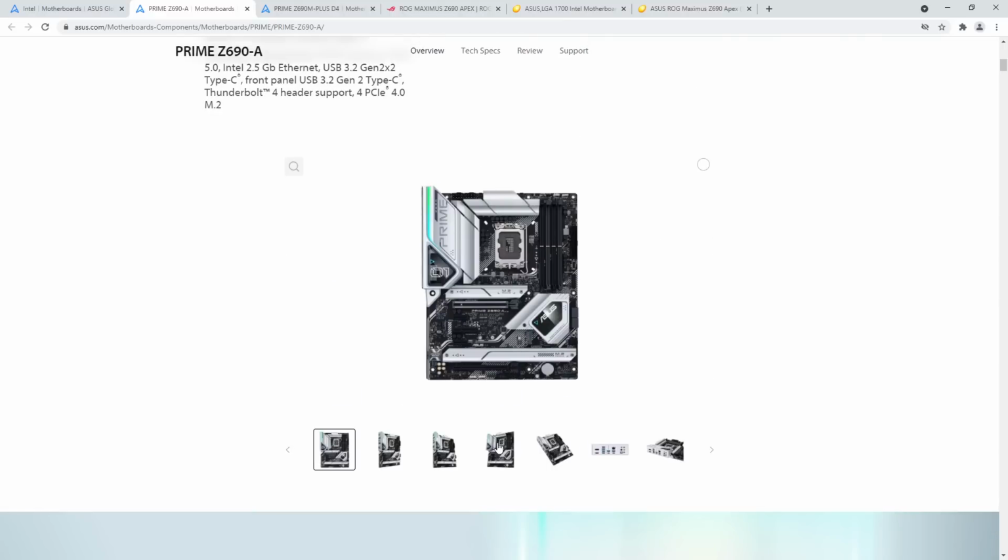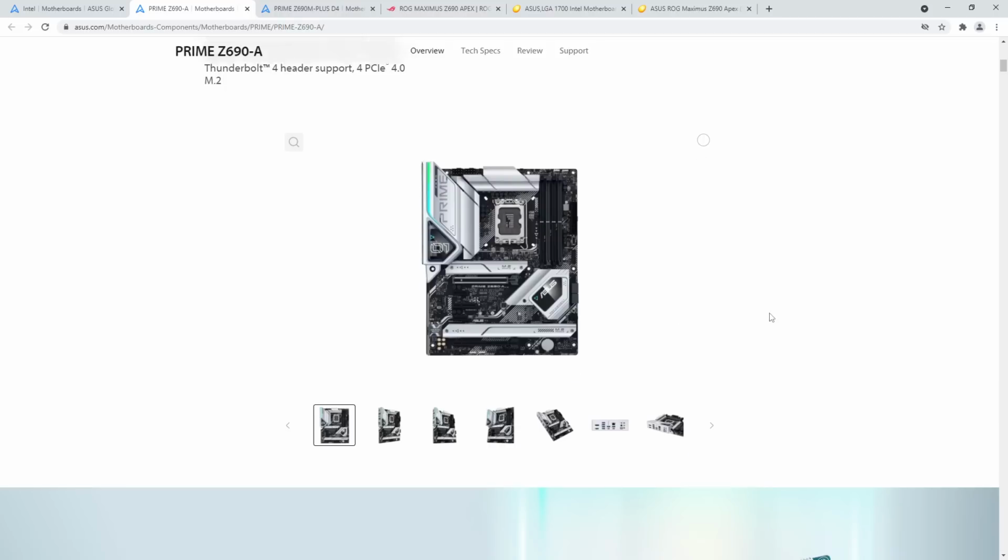Thermally, the thing is, 12th gen is actually easier in terms of power demands than 10th and 11th gen. So that's why I'm not that concerned with VRMs on Z690 motherboards. It's just like, guess what? Intel 7 is more power efficient than Intel 14 nanometer plus plus plus plus plus plus plus. Imagine that. It pulls less power. The node shrank.